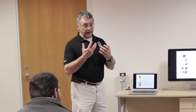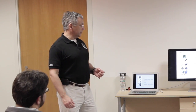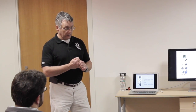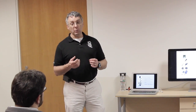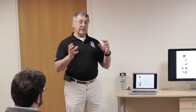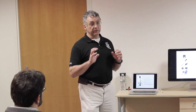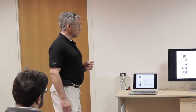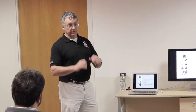Don't just take a circuit board and put it in a mold and fill it full of injection molded plastic. So what they'll typically do is a first pass with a low temperature, low viscosity material. Some of it is not unlike hot melt glue. If you heat it, it just basically turns to water. And so you can mold that around the circuit board. Then you put a thin layer of a higher temperature elastomer on top of it, and that first layer protects the devices from heat and mechanically protects them from the shear force of the mold flowing. The Nike FuelBand has three layers. There's the nylon-based stuff, and then a medium temperature elastomer, and finally a stiffer plastic exterior.